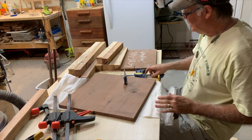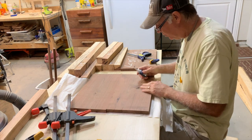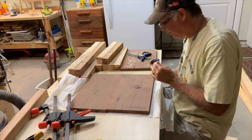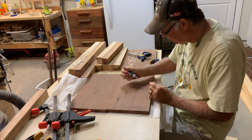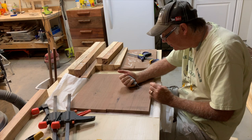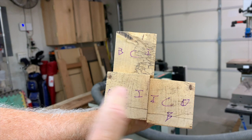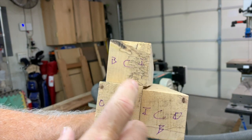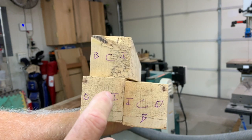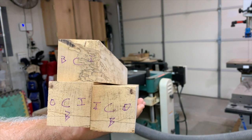I have the two pieces of walnut glued together and did a light sanding at 80 grit. There's a knot on this side — this is going to be the top side — so I'm going to do a little repair and drop some black CA glue in here to fill up this gap. I've marked my pieces inside and outside so these will be the show pieces, and I'm going to plane them to the same thickness. Now we're going to put them on the thickness planer to make sure we have all the right thicknesses.